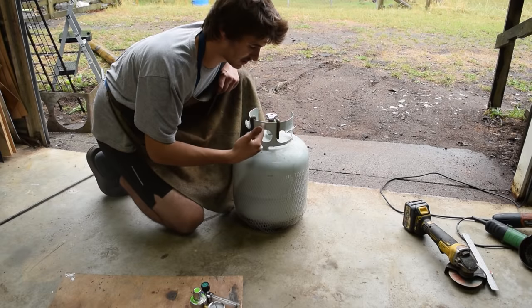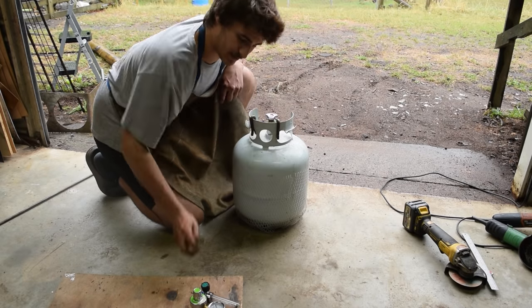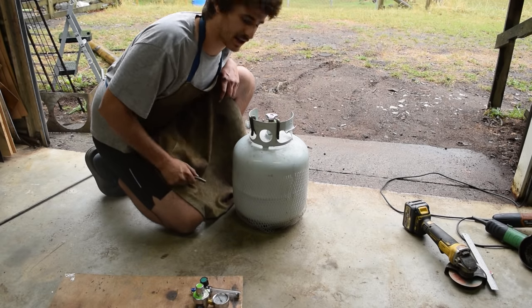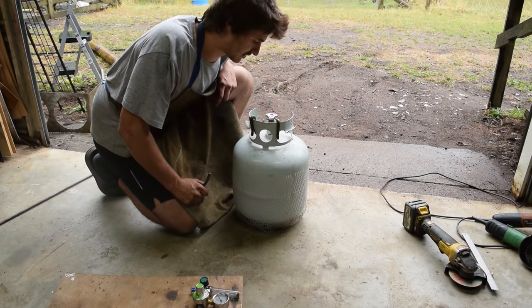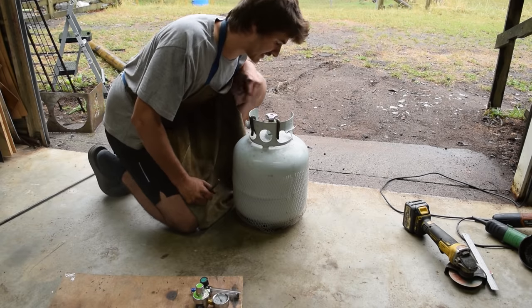You can see how this is going to work — hooks and a bed bar joining the two hooks together, then we can mount the regulator to the bar. Welding this up will be tricky since we can't weld on top of the gas tank, so we'll do some very light tacks, test, and work out the position from there. Let's jump over to the welder and tack this up.